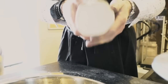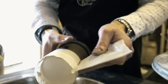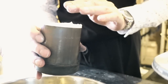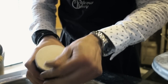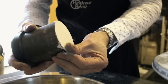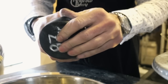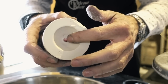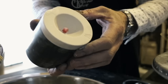We're going to turn it upside down, heat the kiln up, all the wax is going to come out, and then this afternoon we're going to carry on and cast. Now the investment is nice and dry, we can remove that masking paper. As you can see where it's gone and bubbled up a little bit — remove the excess because the top has to be lovely and flat. And there's the rubber base — that tells us the weight of the rubber — and we can remove this. Inside there is the wax tree. Let's just pop that into the kiln.